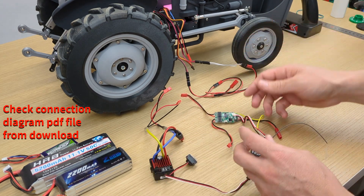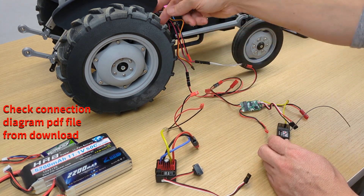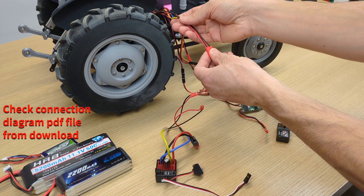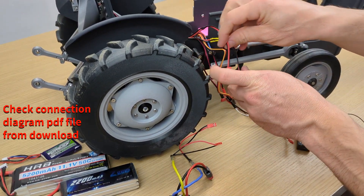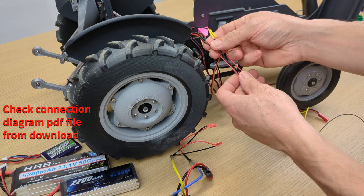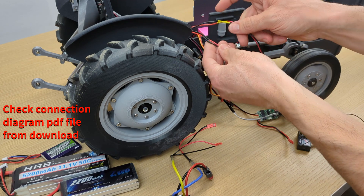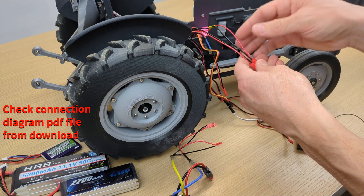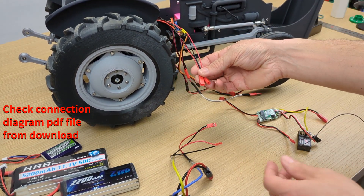There is no particular order, but I'm going to connect the main motor first. These are the cables from the main motors. As you can see, one of the motors should be inversed because they work mirrored. So I solder one cable positive with positive, and the other one I invert — positive with negative, negative with positive — because they work in a mirrored way. Let's connect both motors now.